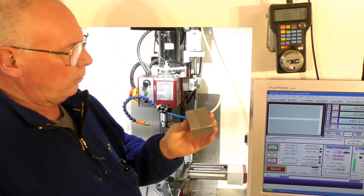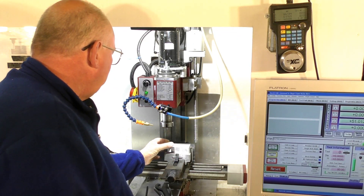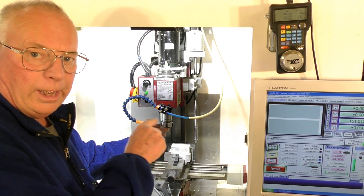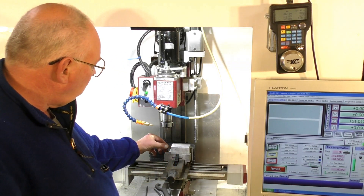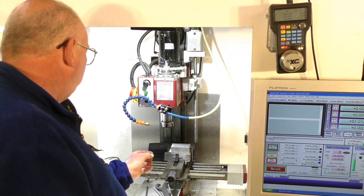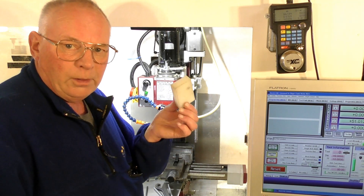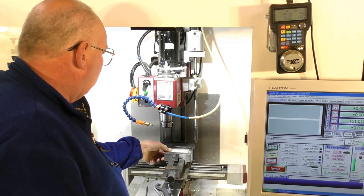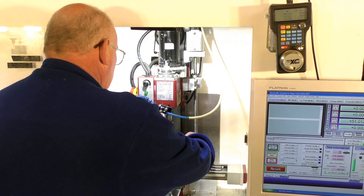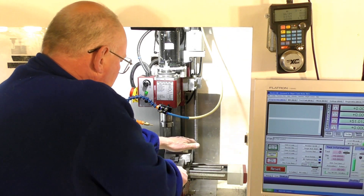Okay, so this is our bar stock cut off to rough size. I've got a very sharp tool put in here because I'm going to set up the XYZ, set it up to the corner of this vise. The easiest way to do that is to put our material in - I don't have parallels, I use a little bit of Teflon so it's not affected by coolant. I'm going to be running flood coolant to machine this. So put our material in there and tighten it up.